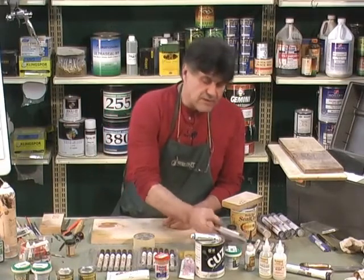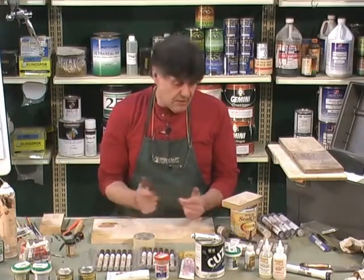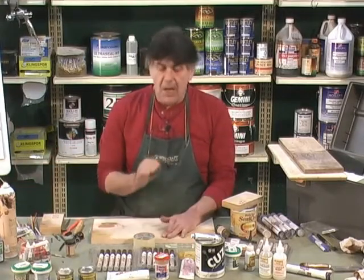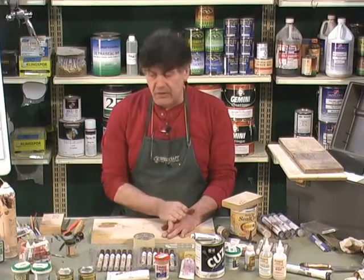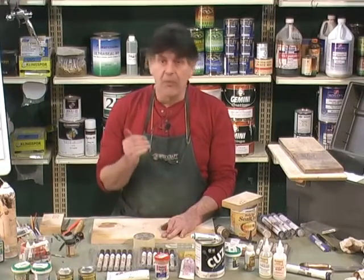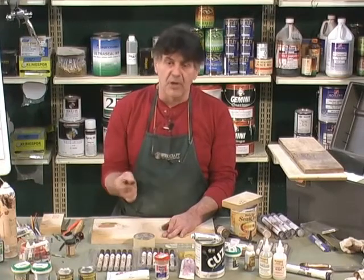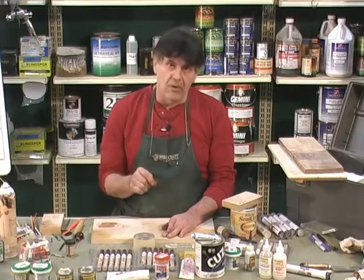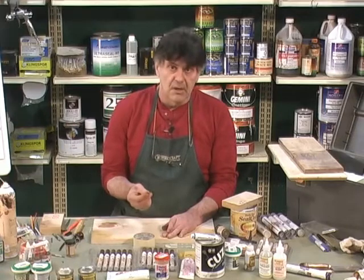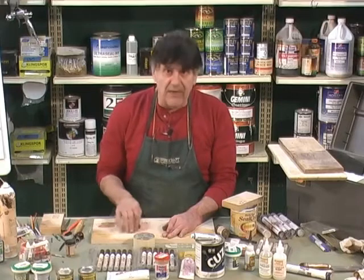We've also got the wax fillers, and we've got the burn-in. Now these work extremely well, all of them. But they all have specific uses and they all have limitations. There's no perfect filler. You know, everybody out here they tell you to use sawdust and glue. Well, that works, except for one problem. Don't use sawdust. It's too coarse. You want to use a sanding dust or a sanding flour, if you will. You want the fine dust.